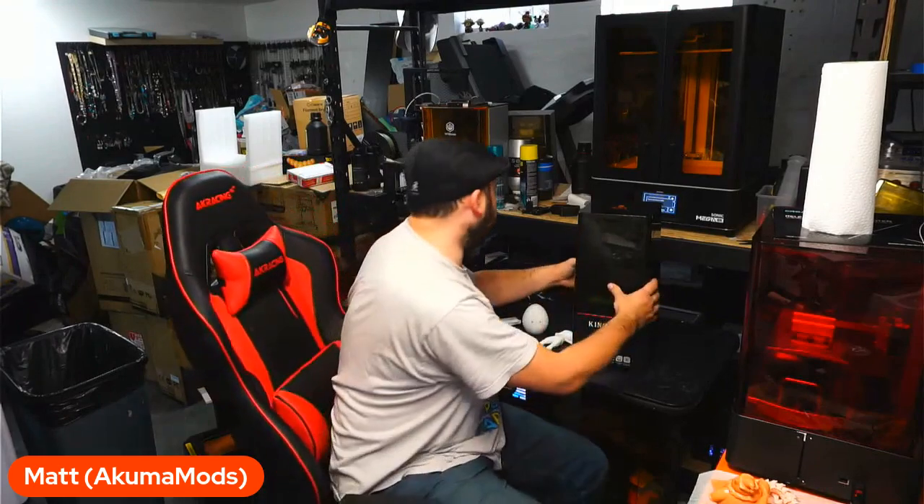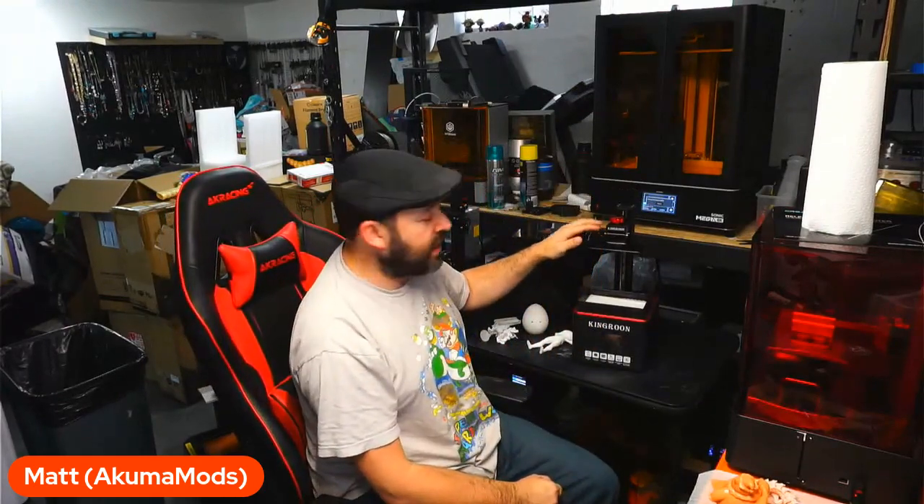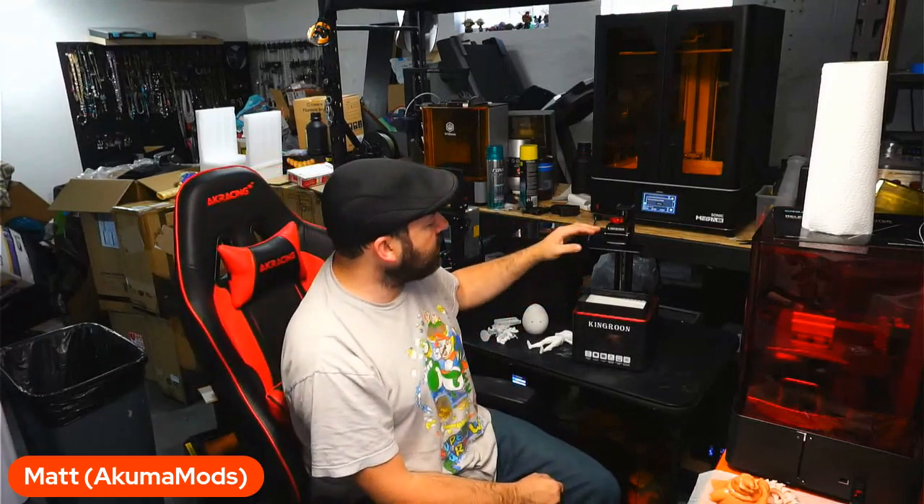With this system, this actually has a four-point leveling system like some of the more expensive printers. Not only that, they also have crush washers behind that. So when you go ahead and level this system two and two, you basically never have to level it again. At least, I've never had to re-level it so far. We've done quite a lot of prints, had quite a lot of failures on it — totally my fault — but you live and you learn.